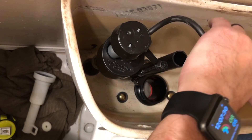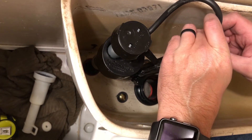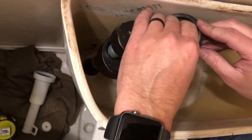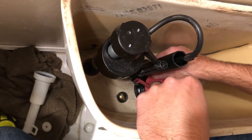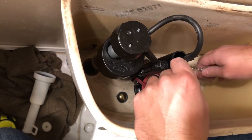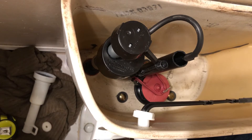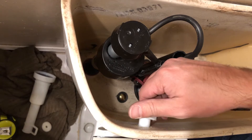Next, attach your hose to the refill clip — I had to cut mine because it was a little long. Go ahead and attach that, then put it onto the flush valve. After that, install your flapper: it just goes right on top, clipping onto those little clips. Then slide your flush handle into its spot in the flush valve and tighten it down.